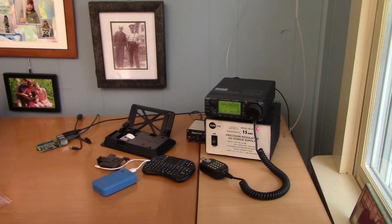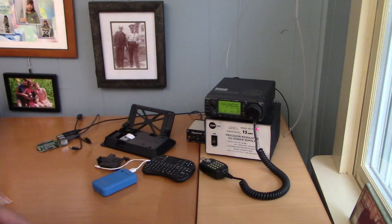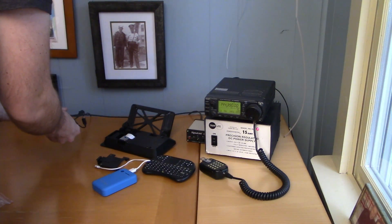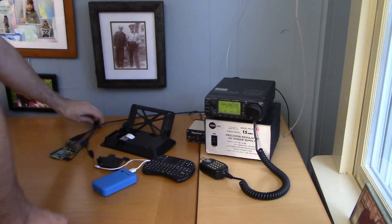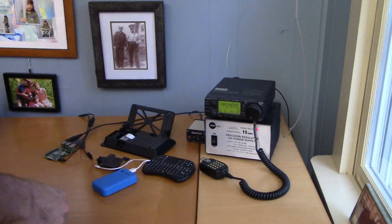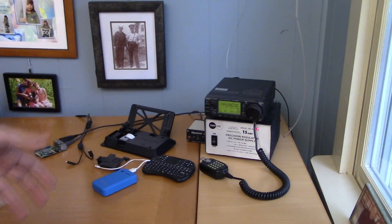Okay, so I need to take a quick break here to play RFI Detective. I've got the radio on, don't hear anything — everything's fine. Let me turn up the volume to make it more obvious. Volume's turned up, everything's running fine. What I did was I plugged in the Raspberry Pi to the wall wart, and then the second that I turn the Pi on, the radio goes crazy. So the Pi is generating RFI — something in the Pi setup is generating RFI.